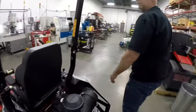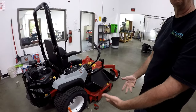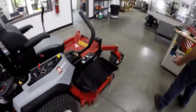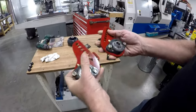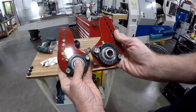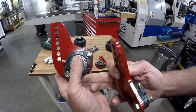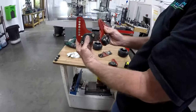One of the benefits of this long roller mounted on the brackets is you don't have to jack the machine up or take the tires off. We can remount the brackets — this is the left side bracket and this is the right side bracket. You can see the grease zerks are up. Make sure you mount the zerk up, not down, because it'll be running into the dirt and you won't be able to grease it. This is a really simple kit to install and maintain.